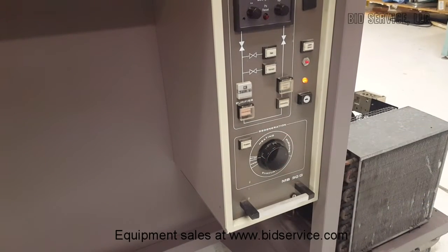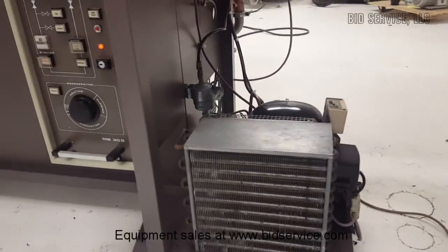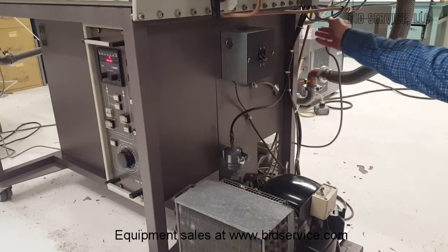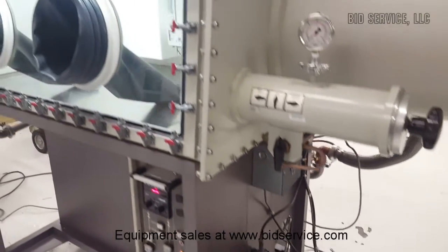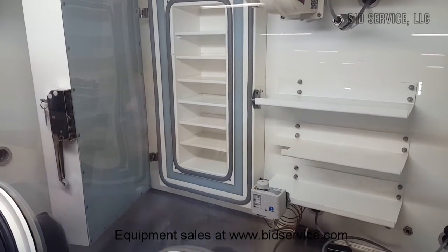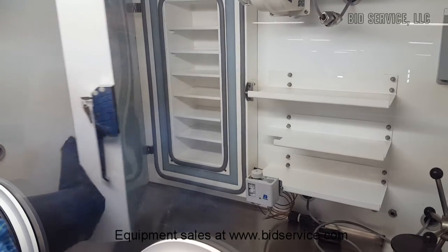Let's go ahead and turn the circulator back on. To the right here you can see this is our freezer unit. Here's our compressor for the freezer. This compressor has been replaced, the freon has been leak checked, and the freon has been put in. We have our main power. So if you look inside, I'll show you the freezer unit — it's got a regen opener door and a few shelves in it. Here's your temperature controller — I have it set at minus 30 Celsius right now.